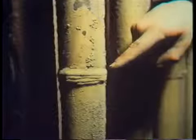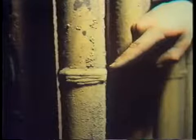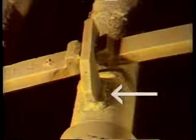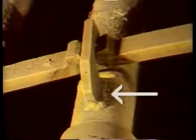Construction welds present other areas for potential failures. It's particularly important to inspect welds in the superheaters and reheaters because they may connect two different metals. Superheaters and reheaters are often made of several different metal types. Bimetallic welds join two kinds of metal and are especially prone to failures. Attachment welds may also be found in the superheater. These welds hold support clips on the tubes. Tube failures are common in the areas around these welds.